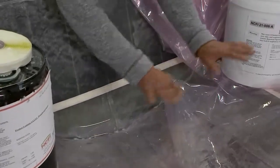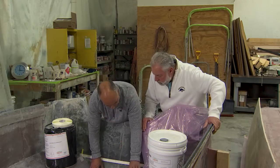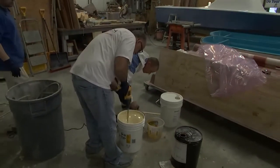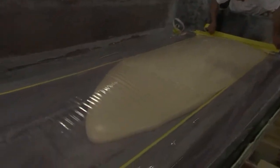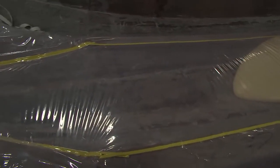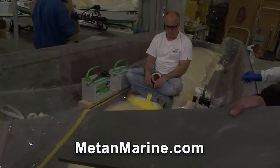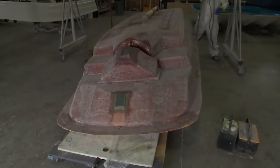We're going to put the bag down very tightly, leaving the back open. We'll mix up 30 pints, pour it in that one location, then put the bag on the last sealant tape. It's going to draw tight — like a real taut roof. The foam's going to grow up the cavity, but we're keeping it contained, drawing vacuum on it. Nobody does it this way.